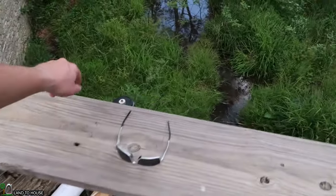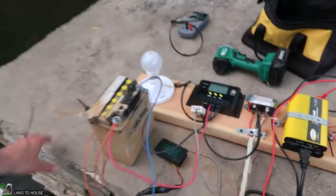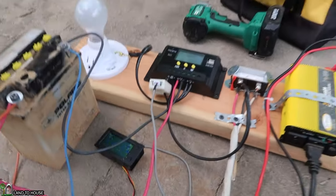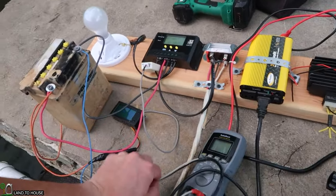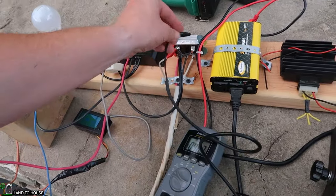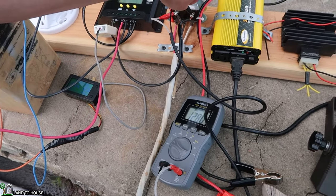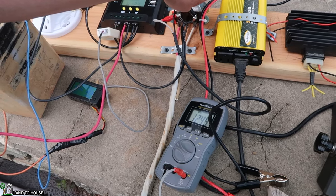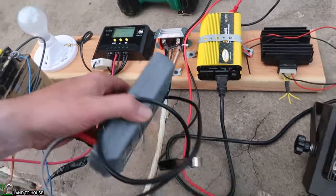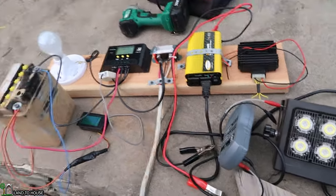We found that this thing open circuit was 45 volts, and it's 12 something whenever, well, we can find that out pretty quick. So I'm seeing a 12.3. All right, so let's just say their highest is 12.8. So it needs to be somewhere at least 14, but it'd be better if it was like 16 volts.